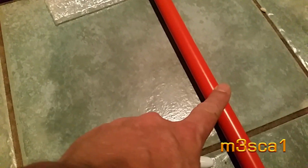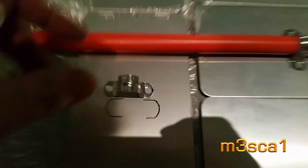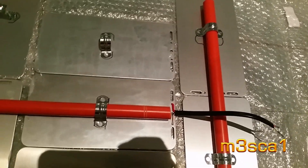Here's a frame assembled from electrical conduit. I got the thicker stuff — the orange stuff is thicker, gives it a bit more rigidity. I haven't glued it yet. These saddles are a bit wonky, sort of pressed metal, so rather than getting it wrong and thinking they're straight, I've mounted each one to a piece, eyeballed the straightness, and left each one there. I'm going to use neutral cure silicone — you don't want acidic cure silicone anywhere near electronics.